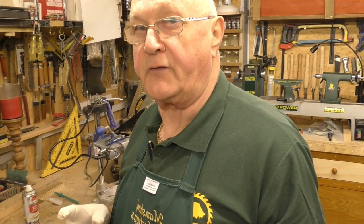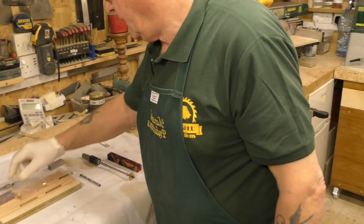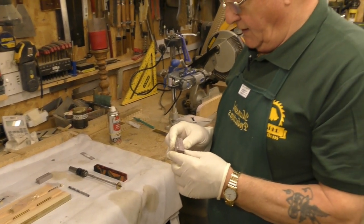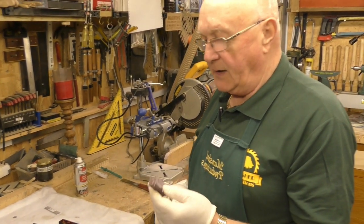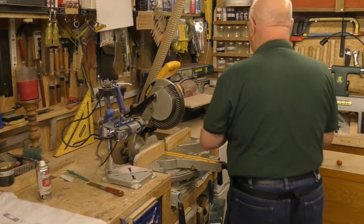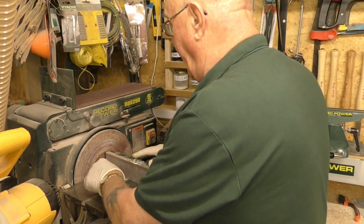I'm not going to expect you to hang around for 24 hours, so don't worry about that. As I said earlier, I've already drilled one of these. That's one I made up earlier. I'm going to go through the process now of drilling one of these because when it comes out of the vice tomorrow it'll be like this — this is one that's been cut in half. Because of the drilling process, we need to tidy it up a little bit. I'm going to take it to my sander to square the end off, and it's important you set this up so it goes nice and square.